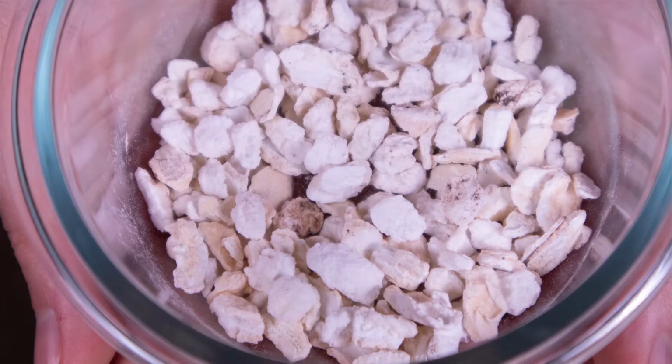In my case, my wife and I spent about 3 hours back flushing, filling, draining, and repeating that process. Each time we did that, a little bit more sediment did come out, but it would eventually get fully clogged again within a couple minutes. So I really don't think we were able to get enough sediment out to be helpful.